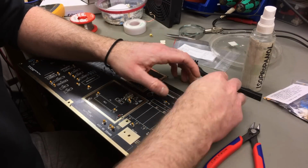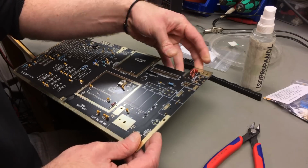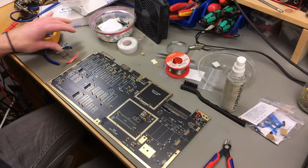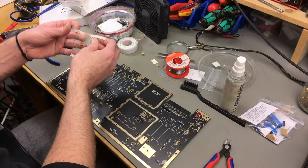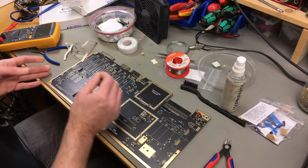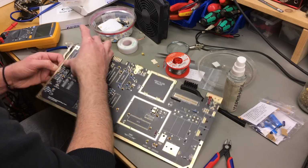Okay, so this is where this goes, because it's a filter for the input. It's actually a film capacitor. I mistakenly put it in here. A couple of standard 1N4148 diodes. These are the most common diodes you can find, so I have plenty of those in stock. And again, they have a ring that indicates the negative side, so it's marked on the board as well.